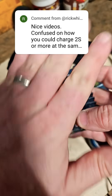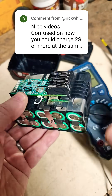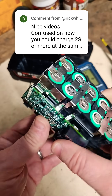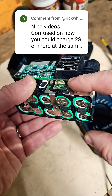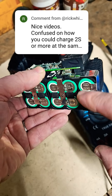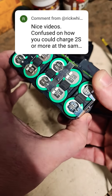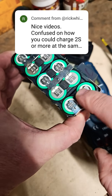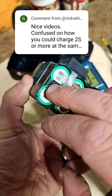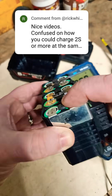I think you're confused by the fact that there's a BMS board. If I took this BMS board off, it wouldn't change the fact that I could charge 2 banks of cells at the same time. Because of the way they're connected — this is the plus side — these are 5 banks connected to their pair, or their mate, or their non-binary love partner, whatever. These are connected together in parallel, but they're connected to the other parallel pairs in series. So this starts off at 4 volts here.